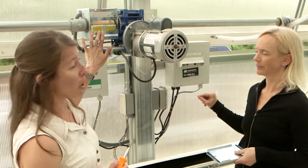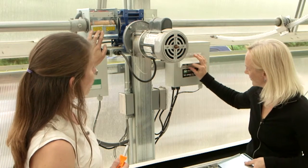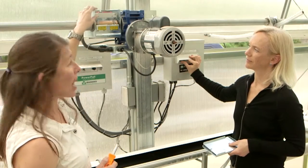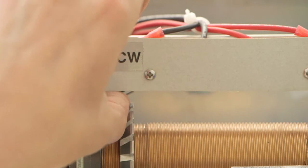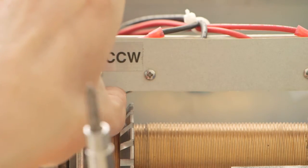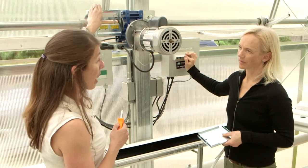The first thing we're going to do is come over to the internal limit switch. Go ahead and run that motor in manual open. As the motor is opening we can actually see that this bronze sleeve is moving, and when I go to set the limit I can stop the motor using these small switches inside the internal limits.